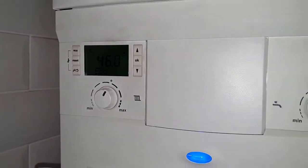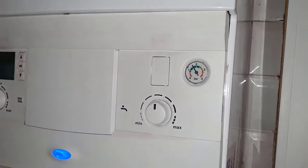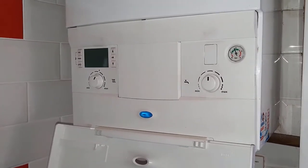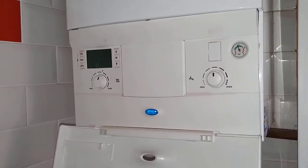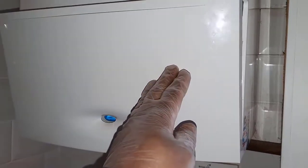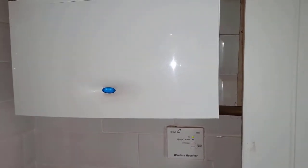It sounds like a washing machine going. I'm running hot water mode at the moment. Basically we've got a blockage — on this boiler it's normally a blocked condensate trap. The emphasis of this video is to show the technique of how to take the trap out. I'm also going to explain how you get the cover off, because on these compact boilers that's not really straightforward.